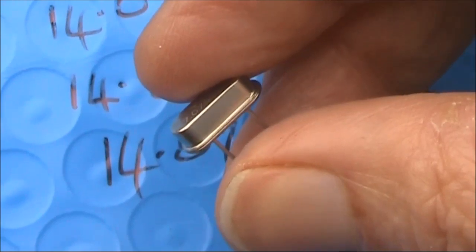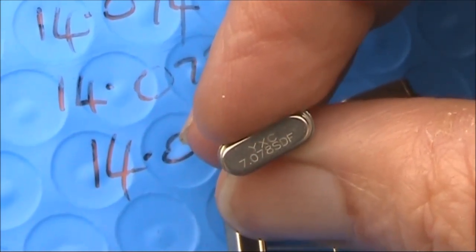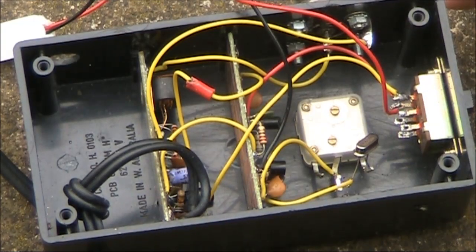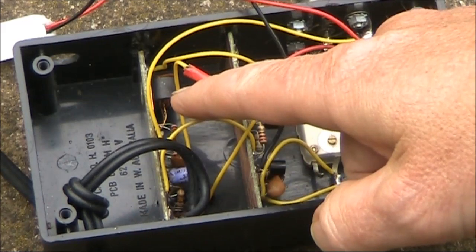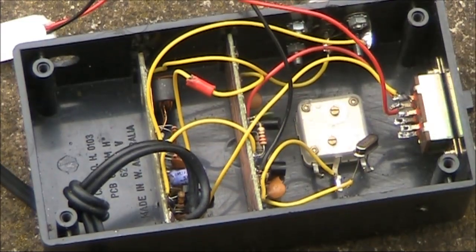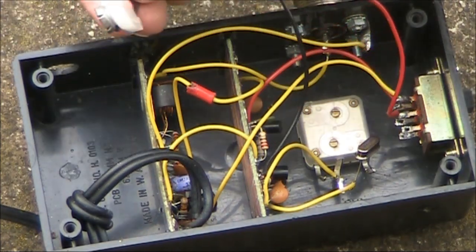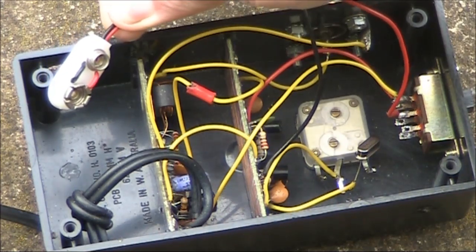As you can see, these are small format crystals, and the frequency is readable on the top of the can. This is the test receiver I'll use to see how the crystals go for receiving FT8 on 7MHz. It's a very simple direct conversion receiver. There are two boards: a two-transistor board with a crystal oscillator and a buffer stage, and a product detector with a one-transistor audio amplifier — that provides more than enough gain to go into the computer sound card. The whole unit is run by a 9V battery, though you could possibly also run it off your computer's USB port.